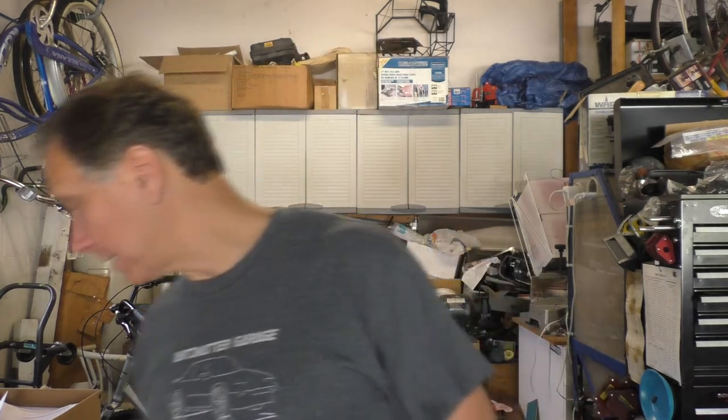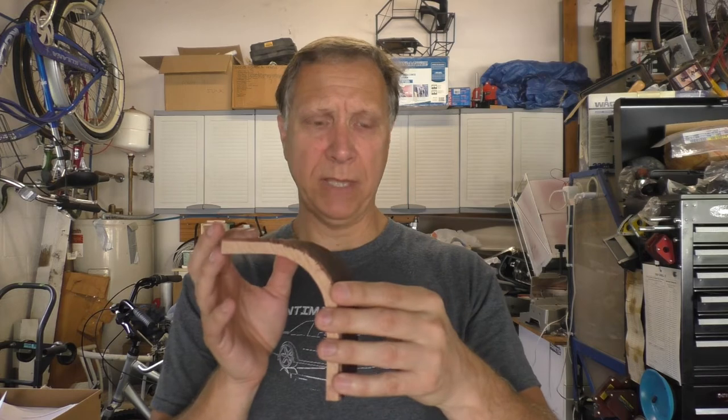So what I did to mitigate that was I cut a series of these curves, and you'll see pictures of it without the stain because, like I said, I'm going out of order now. I had some problems cutting them and they got messed up, and in the end though, I was able finally to make this piece, and unfortunately it doesn't have the look that I want because these are all end pieces now instead of along the grain. And I also wanted to stain these separate from the rest of the unit. So what I did was I tacked it and then sanded it.